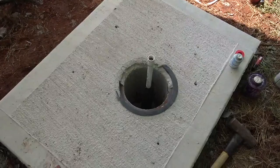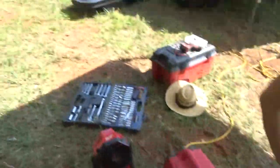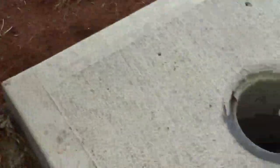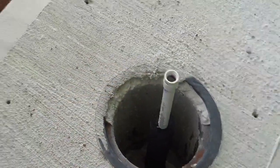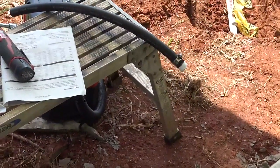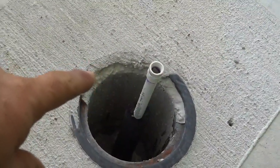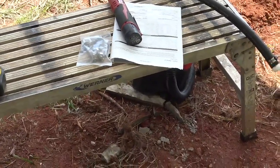We have tons of volume — no problem taking care of 20 to 30 cows in this pasture because we have plenty of volume feeding from the tank on the hill with inch-and-a-quarter feed. We brought inch-and-a-quarter Schedule 40 up through the heat well, put a female adapter on here, and we're transitioning to the rubber hose they supply in the kit. They give you all the hardware except for that female adapter — you need a three-quarter female adapter to transition to this hose. They even give you the wedge anchors to lock it down.